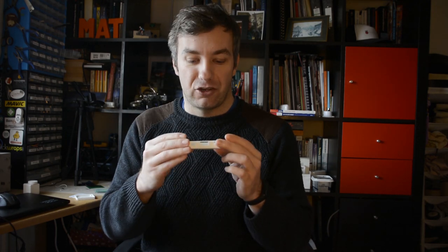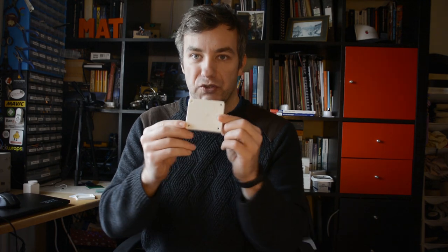Unfortunately, due to my mistake, I had to wait two hours for the first print just to find out the cover wasn't constructed well enough. I also had a problem with holes — my printer was not able to print holes as neatly as designed in the file. Fortunately that wasn't a big problem because I simply used a drill to drill through the holes again to make them bigger and fit the screws and bolts I had prepared. That also meant I had to enlarge the holes in the Raspberry Pi board itself.